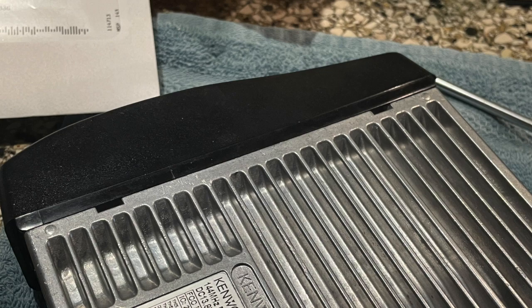Using two flathead screwdrivers, slightly pry on both clips at the same time, and the display will let loose. And be careful, there's a ribbon cable. You can just kind of fold the front of the display over and support it so you can see the back end of the panel. And you can feed two wires through where that ribbon cable goes. So those will be the next solder points that we're going to work with.